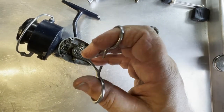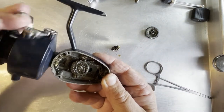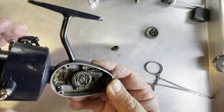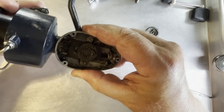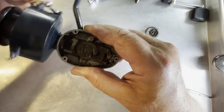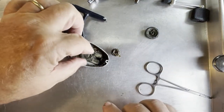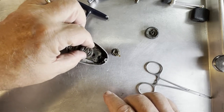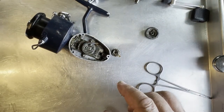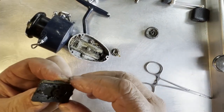Now we've got this gear right here. This is the one that I'm suspecting is a problem. It's not doing any good to rotate at this point, but this should still move up and down — and there we go, we're moving up and down. Rotating that doesn't do it because you've got it disconnected, but this should cycle through. And as we rotate it, it stops right there. Let's go the other way — and it stops again. I believe that this is out of synchronization. So what we're going to do, we're going to lift this gear out and look at the two of them together.